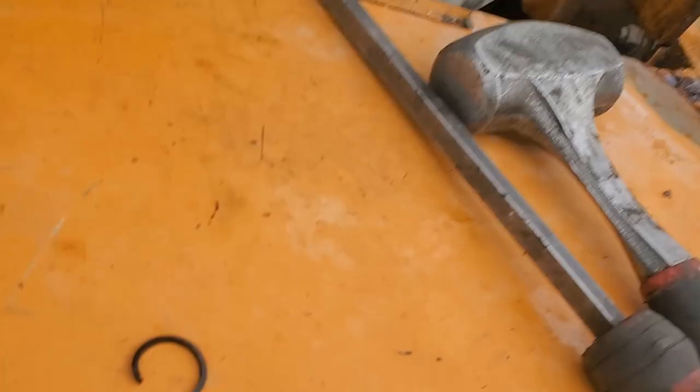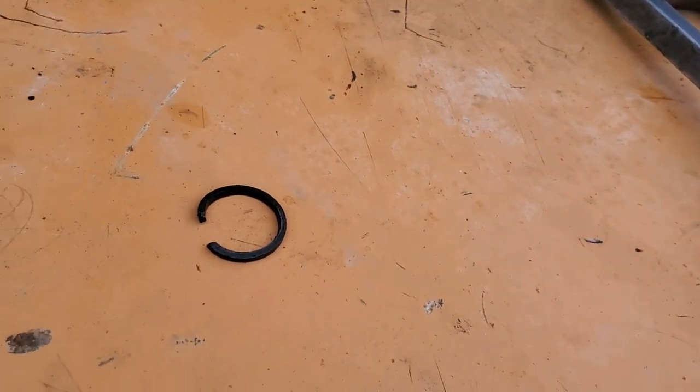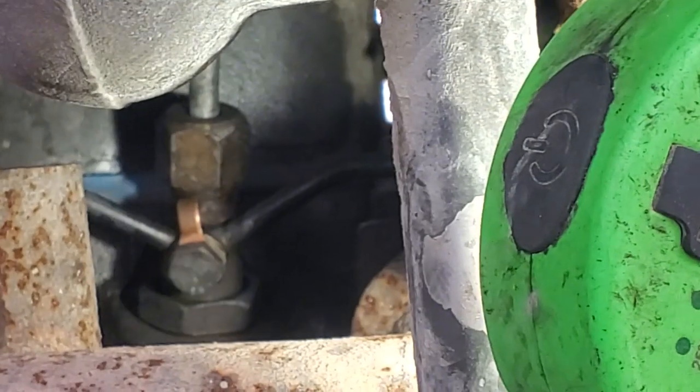But anyways, it ended up being that seal got behind this, and when I crushed it down, it deformed the crush washer, so I had to dress it. But yeah, what I'll end up needing is a whole new set of these, so that way it keeps all the crud from getting down in there and seizing up and all that kind of stuff. But we are fixed.